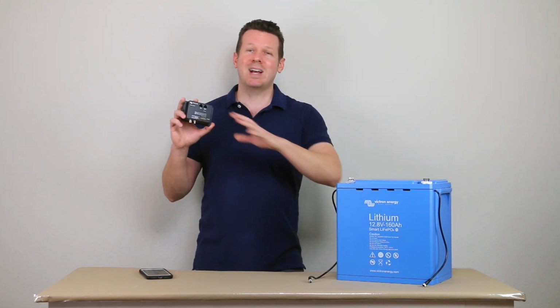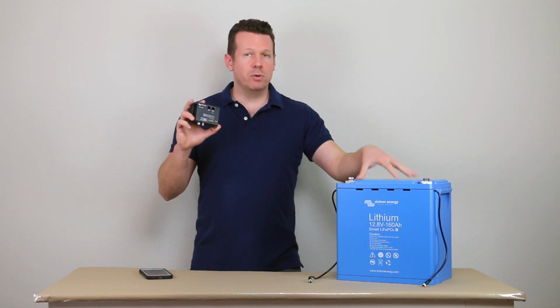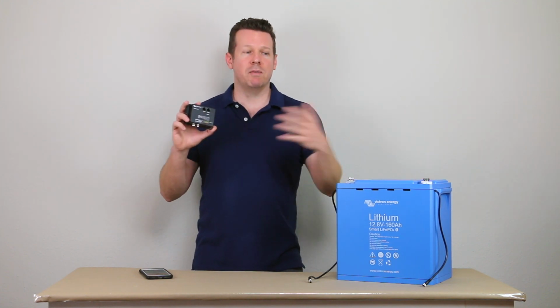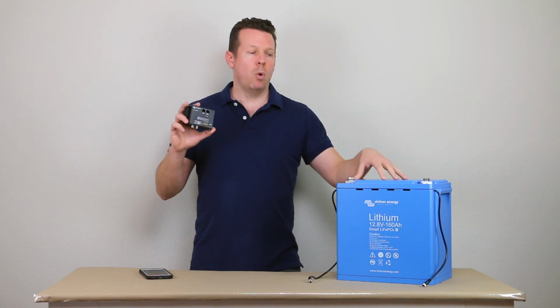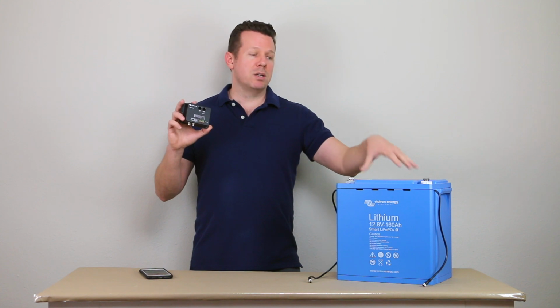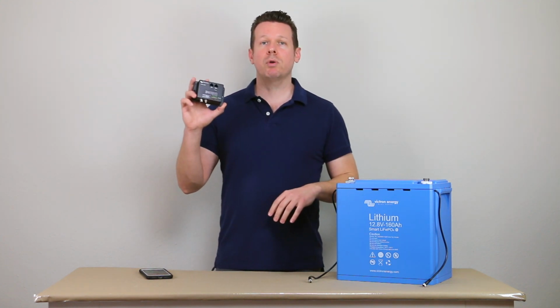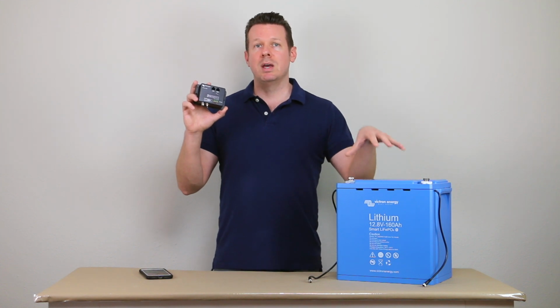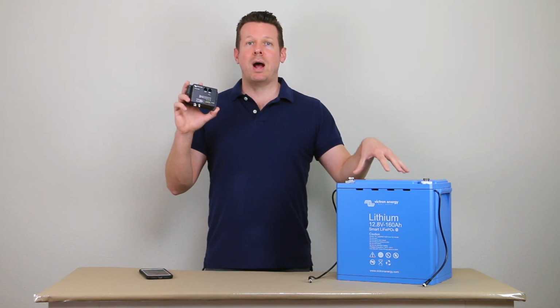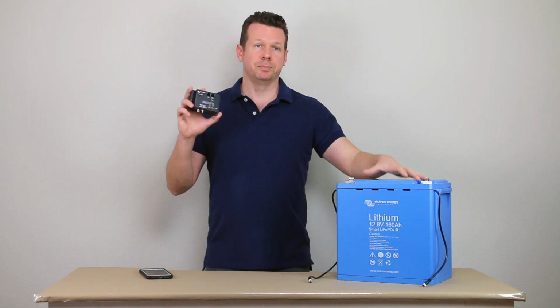So it's kind of just the guide rails, and you may have seen in some of my other demonstrations, I'll use this battery without a BMS if I just want to turn on a light bulb or give a charge for a few moments. The battery is operational without the BMS, but this is the guardrail that's going to protect your investment and make sure things do not go outside of their acceptable ranges for voltage or temperature.